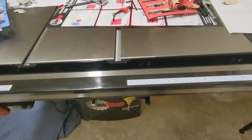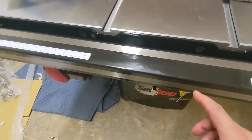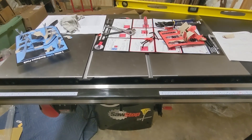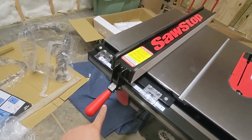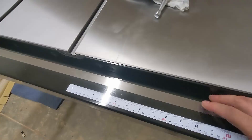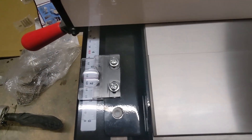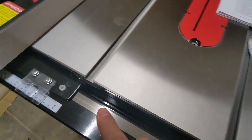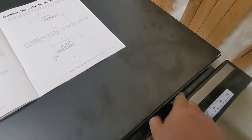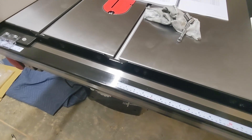Next, I attached the guide rail ruler to the bracket, secured on the bottom with seven screws. It all comes greased up to help keep it from rusting and is super heavy duty, so just be careful it doesn't slide off onto your face. For the fence, you put on the handle, slide it between the groove of the saw and the measurement rail, leave about a 32nd of an inch gap, and tighten the bolts underneath to keep it nice and straight and secure all the way down.